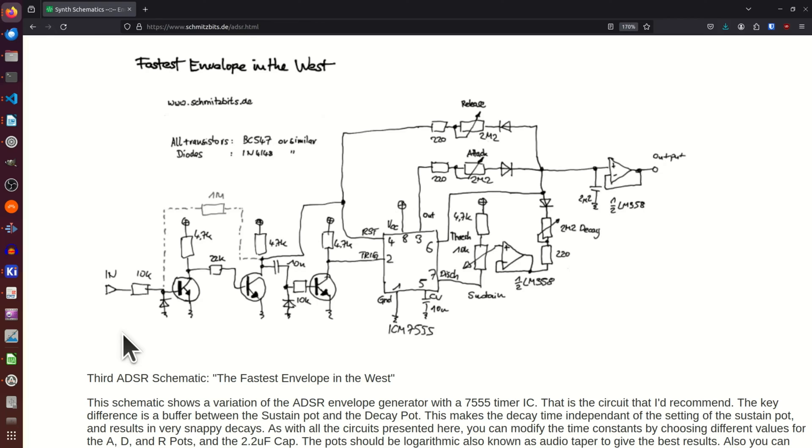The idea of the circuit is quite simple. There is a capacitor that is going to be charged and discharged, controlled over time by the 7555 timer IC. The section you see here is to condition the input signal to have a short pulse to trigger the timer.